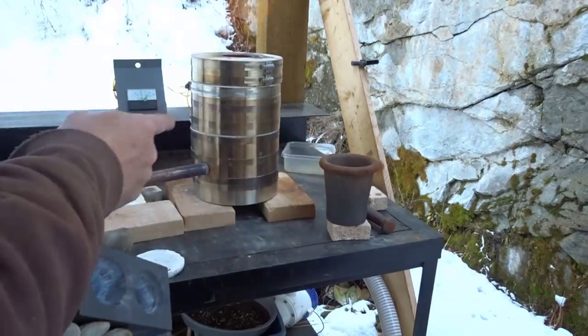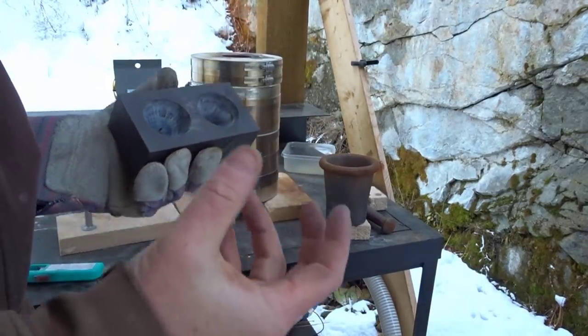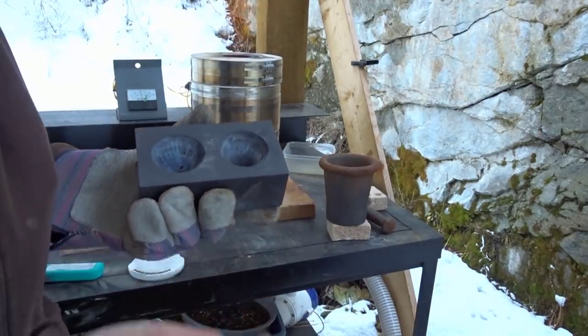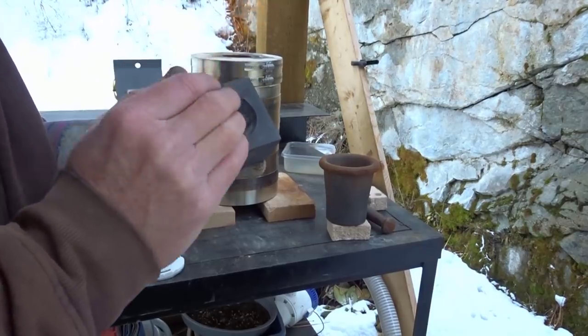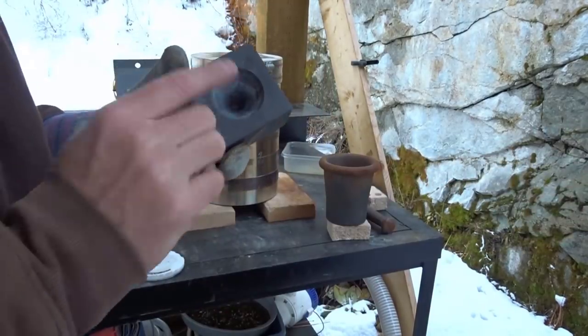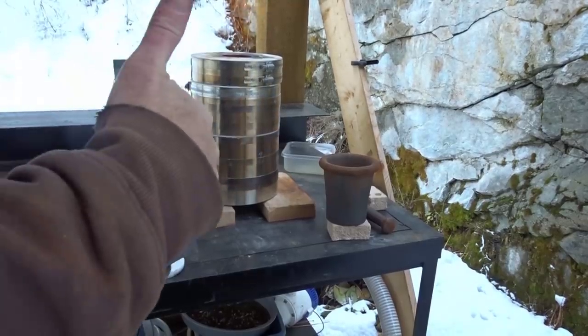Now, the problem with this material before is the chemistry didn't happen completely. The black sand melted into the gold, some of the flux probably melted into the gold, and when it went into its mold, they stayed together. They didn't separate gold versus the crap. So hopefully today, in our little experiment, in the conical mold, they'll separate out nicely and we'll have a pure gold button. Let's hope.